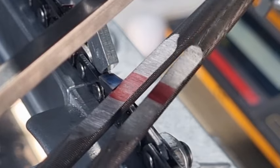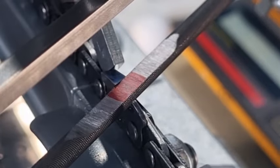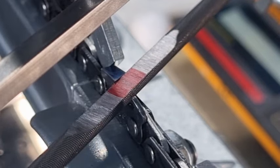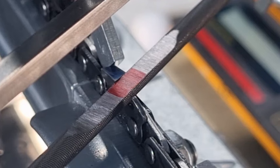I've got another two sizes — this is the 5.2 millimeter version, and this is for the 3/8 low profile, so this is a 4 millimeter file. Now the next question is where do you get these file gauges? Well, it's something I came up with — I just made them up. I had a few spare files laying around and I thought, one of the worst things is I can adjust the top plate angle and do 10 degrees downward tilt, but the depth is something you're going to guess. I needed to eliminate that error, and that's where I came up with the file gauge.